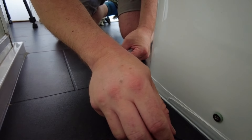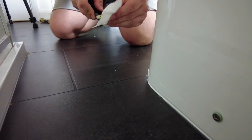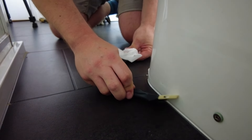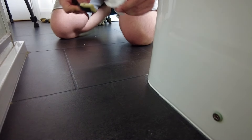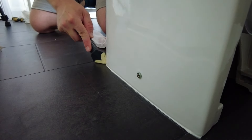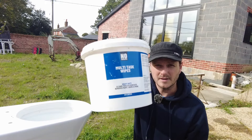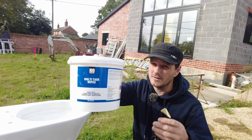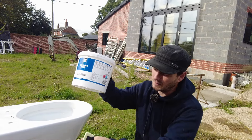I added it at the wrong angle initially, so I'm just going to get the excess off. I've turned the tool round so I can wipe it. I'm just going to do that a few times and move that excess up away from where the actual proper silicone line is. One more pass down the bottom to make sure I haven't got any excess on the floor. For the wipes, I use the no-nonsense ones — other brands are similar. I'll use the toilet roll and the tool first, then use the wipe to get the excess residue off the toilet and the floor.